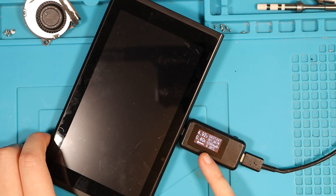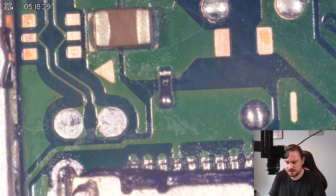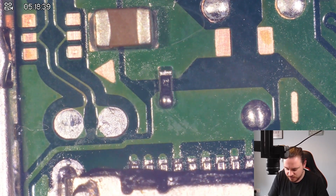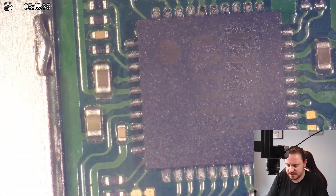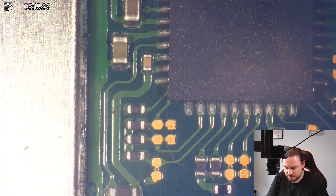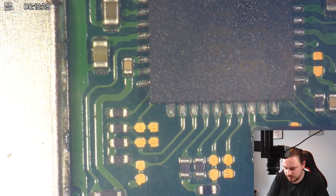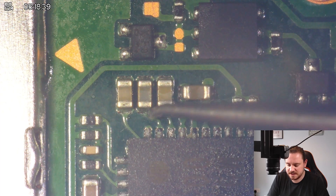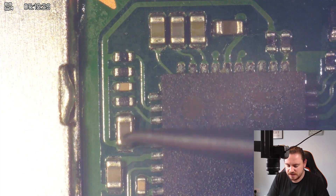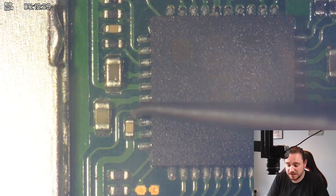Let me take it out of the housing and do more testing. The meter is in continuity mode. I'll test the fuse first — fuse is fine. Going straight to M92: this capacitor here underneath... wait a minute. The three caps — this is where I had the fault last time. This cap's fine, this cap's fine, but this one isn't.